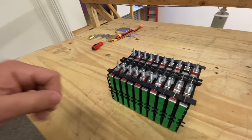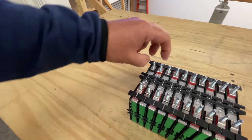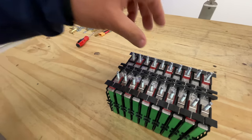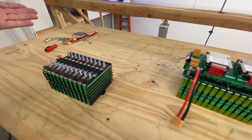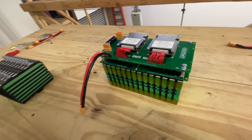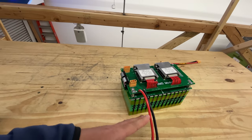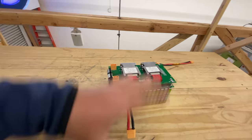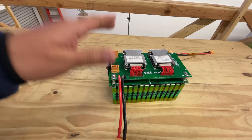The bad thing is they're kind of weird to work with because they're kind of small. You have to figure out how to put these together — like you've got to drill holes and put bus bars on copper or aluminum. Or you can do like me and design a couple of circuit boards like this, which makes it about 10 times easier to assemble. This is a complete battery pack. You can parallel 10 of these, use them standalone, or put them in a bigger array.